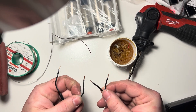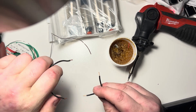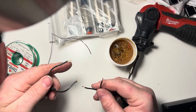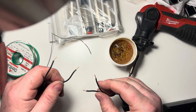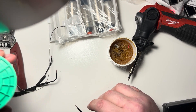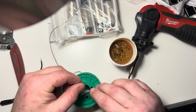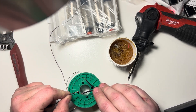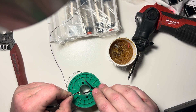Again, there's one wire that's ribbed — that's this one and this one — and then this one has writing and this one has writing. So we're going to solder these together like this. I don't use helping hands. What does help is sticky tack, like blue tack. It's almost like bubble gum but it's sticky. I usually have it on the back of my solder roll so I could push these wires down into the blue tack and the other would be held in place.